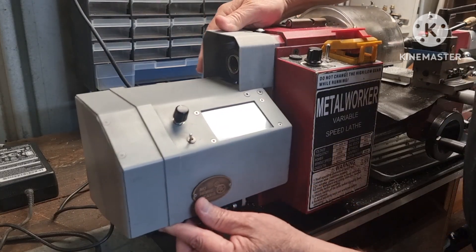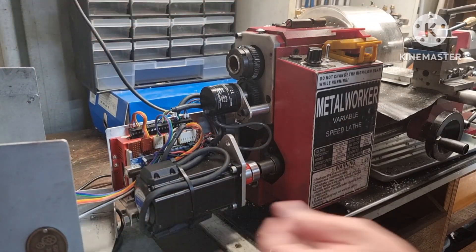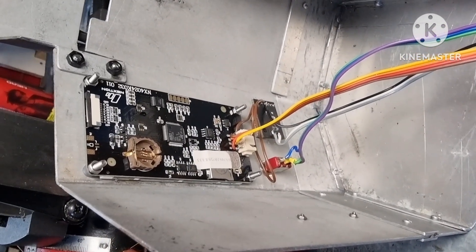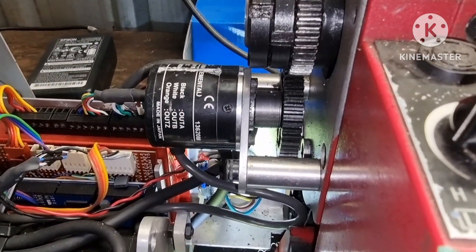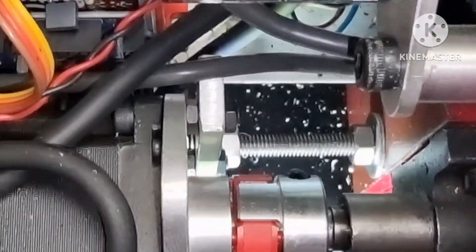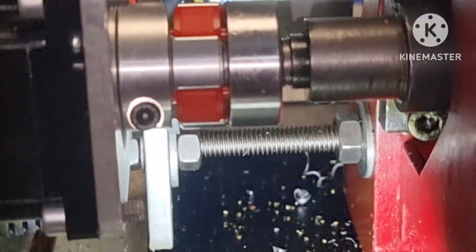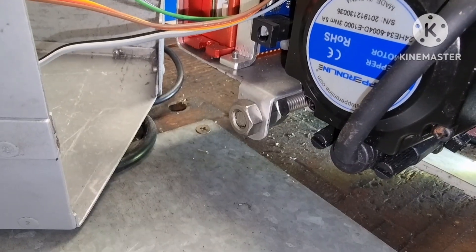The entire case can be removed by loosening a screw at the top, giving easy access for any adjustments or oiling. Mounting of the screen and the switches inside. I've mounted the rotary encoder onto the spindle using one of the old plastic gears. The entire build utilizes all the existing holes. I've used an 8mm threaded rod to mount the back of the case, along with a motor which is direct driven into the lead screw, and bolted to the bottom of the back of the case with an adjustment system.